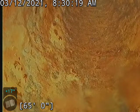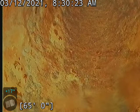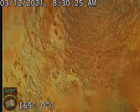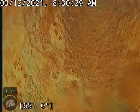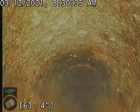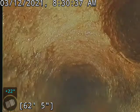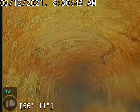We are at the inner portion of the house, going up the vent stack slightly — not going all the way up — but this is our vent stack and we are in cast iron. We did run our chain-knocking machine through here to smooth up this cast iron. It did have quite a bit of scale and now it's looking a lot better.